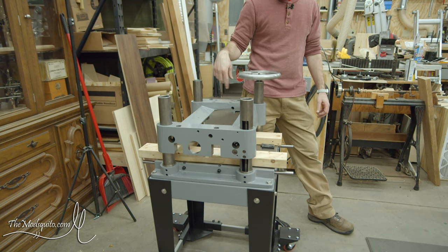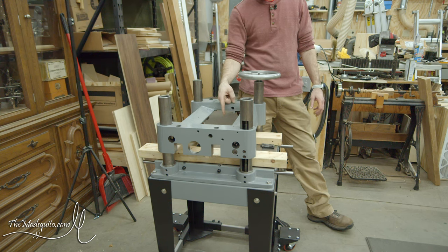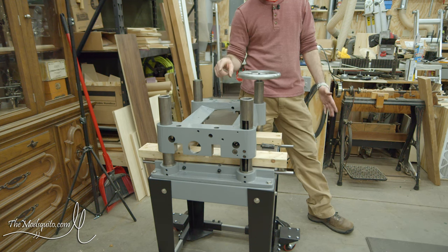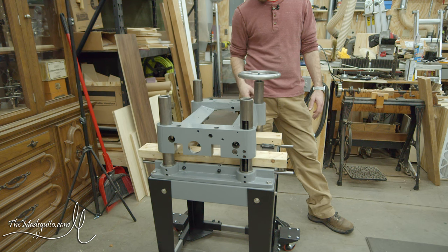So, yep. All right. So what I'm going to do is basically squeeze the cutter head in over here, lay it on the 2x4s, kind of get things lined up over there, drop my bolts in place, and then we just have to get the bearing to seat on that end and get the gearbox situated over here.